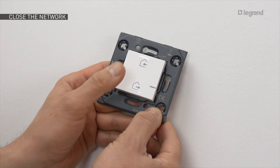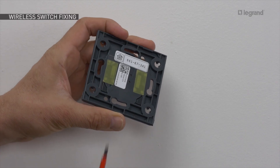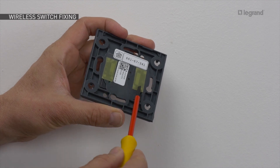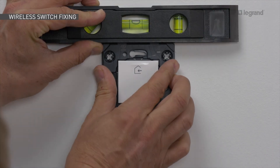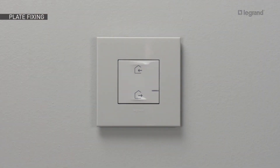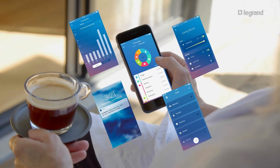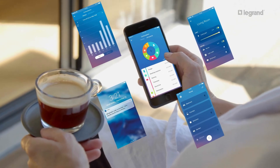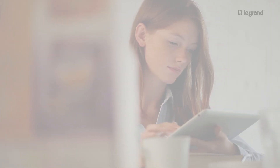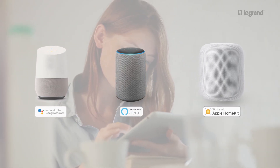A short press in the middle of the master switch causes the LED to blink three times and all products switch off their LED — all products can now be controlled by the home and away wireless master switch. Place the stickers provided on the back of the wireless home and away master switch. Finalize your installation with your preferred finishes by clipping plates onto all the products installed. Your connected installation can be managed remotely using the Home and Control app, and can also be controlled via a voice assistant such as Google Assistant, Amazon Alexa, or Apple Siri.